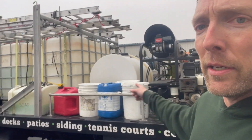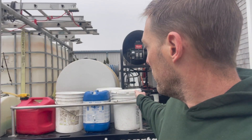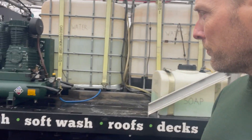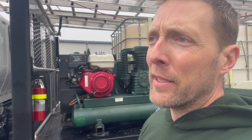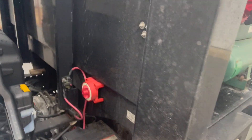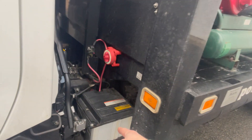On this side of the rig I've got a chemical rack. Depending on the jobs I'm going to encounter that week I'll have different buckets of different chemicals. Underneath is more storage, gas for my compressor, and a 16-gallon soap tank. The air compressor is a Roll Air — again a Honda machine, I think nine horsepower. The All Flow air pump recommends at least six and a half horsepower, so again I'm a little overkill, but too much air won't hurt anything. I also put in a switch so that if the electric-start big power washer battery died, I could throw this switch and start it off the truck battery.